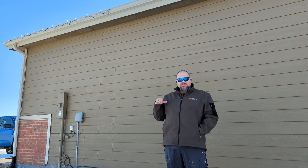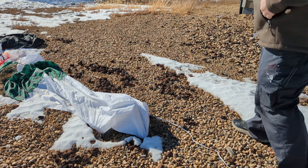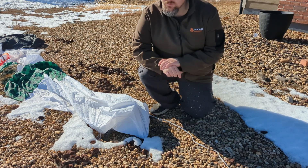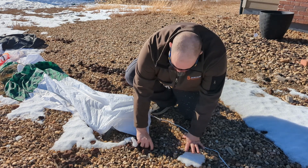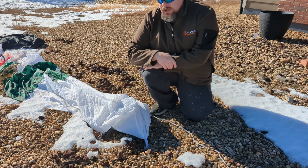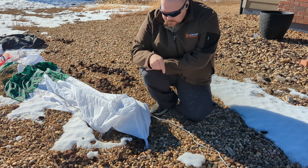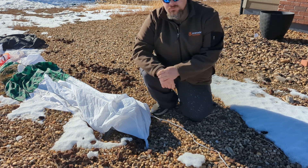So we have to make sure that the installation on this side is rock solid. One question could be: why not just use a ground-based install? After all, they provide a tripod. Well, this is why. We tried to run a blow-up Christmas decoration this year and the winds here are so strong they actually ripped out the heavy-duty stakes and tore the fabric apart. Because of the wind loads here, the tripod with stake holes won't provide the stability we need. So the only possible option for me is a long wall mount.